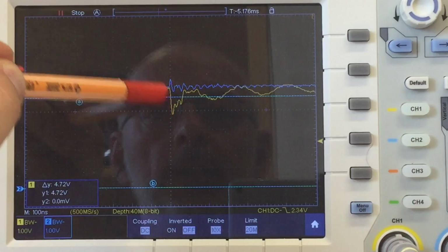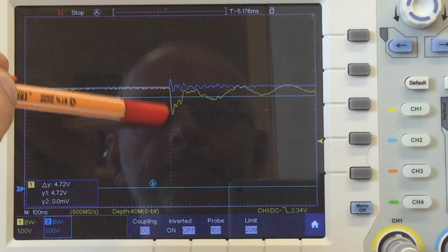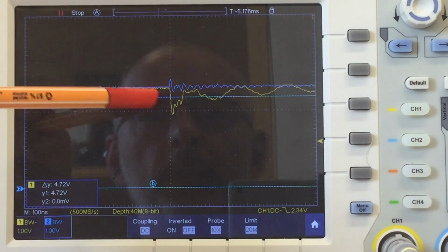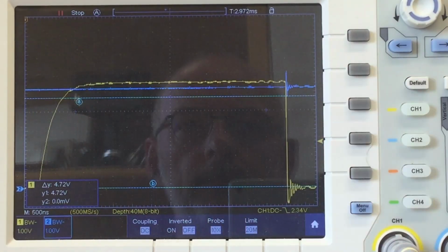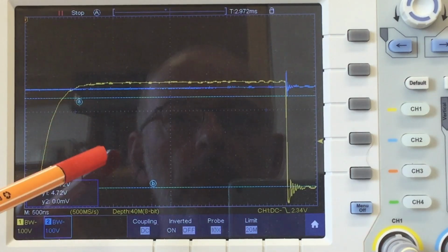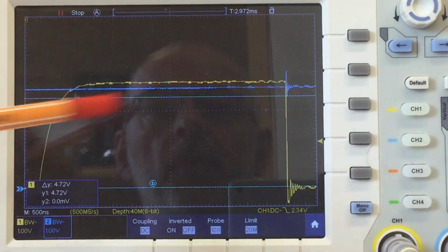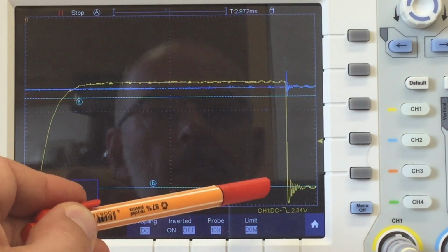But we still have here an undershoot, yeah, that crosstalk from the other sensor. Yeah, that's easily 1.4 volts. But it's not going too far down that it could be interpreted as a low by the DS18B20. My signal, yeah, that's a short pulse. It still looks okay. We have also here the ringing, which is, yeah, a good volt. Peak to, more 1.4 volts on the power supply. But yeah, and here that ringing, it's not nice, but it's a one-wire bus.